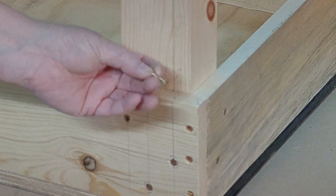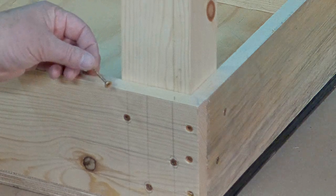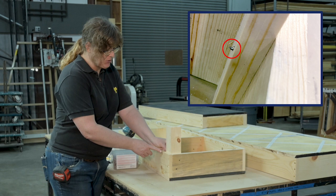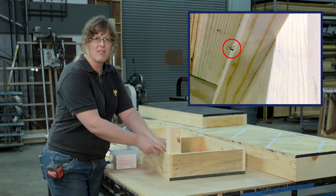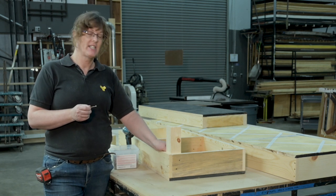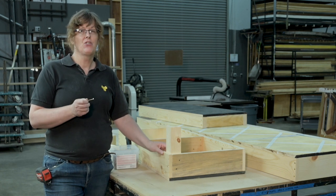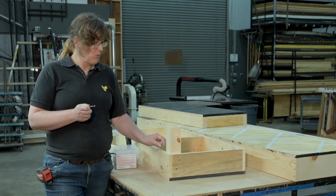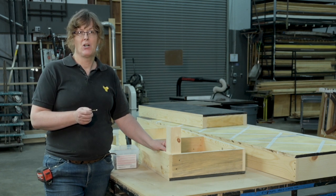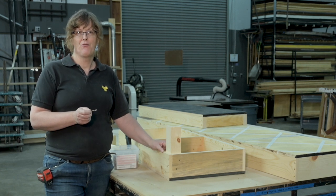Especially since I'm using one and five eighths inch screws — that screw is going to be a little bit wider than three quarter inch pine plus three quarter inch pine, which is one and a half inches total. One and five eighths is an eighth of an inch bigger, so it's going to have a little pointy thing sticking out, and I want that on the inside. Use one and five eighths inch screws because one and a quarter inch will be too short, only getting two or three teeth into the piece — not enough to hold. For going through one-by into other material, one and five eighths should be good for most everything, or maybe two inch screws if you need a little extra strength going into a 2x4.